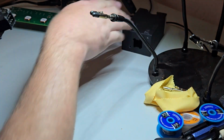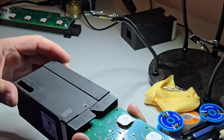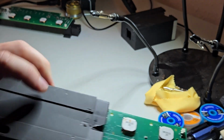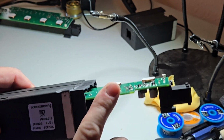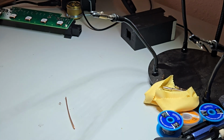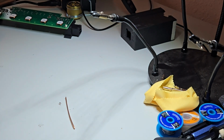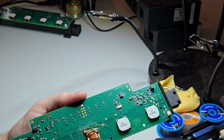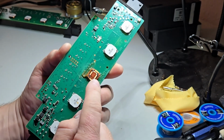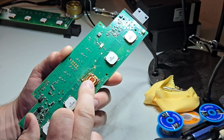Okay. So this one was damaged a little worse. Plus the box is pinched real bad. Like you can see how it's broke and pinched. So this one is going to be my donor for parts. Even though they both have the same failure, I worry about how pinched the board is, that there's more damage than just the inductive pickup. So I was trying to see if there was a specific part number underneath the tag. There is not. So I'm going to desolder this one.